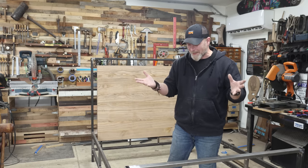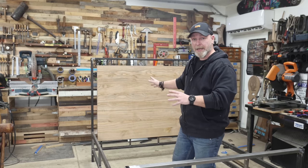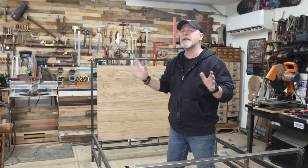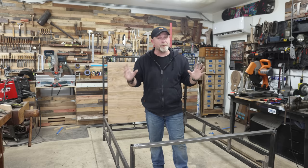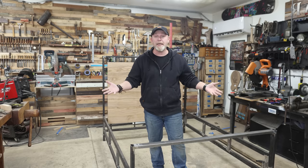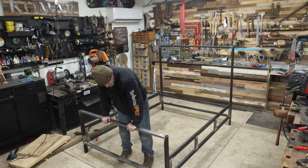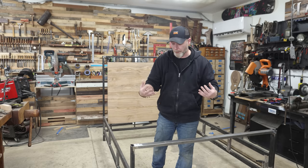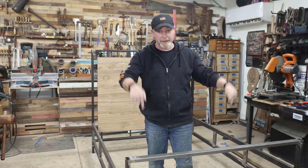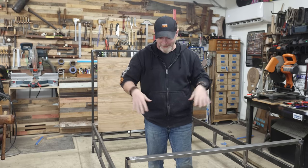It's going to work — the back looks fantastic. It's sturdy as heck, and once we epoxy those posts in and weld them in place, it's not going anywhere. For the front we're doing something different because nobody's going to be leaning on it. There's no need for all that support, so if we sit it on rods from the bottom and then pin it in place from the top, we'll be okay.